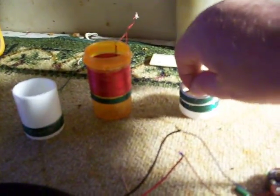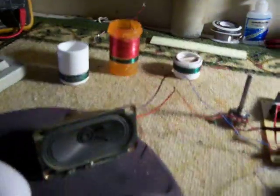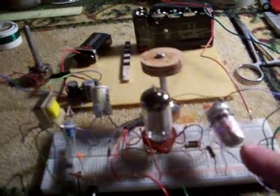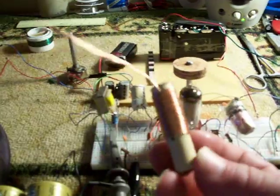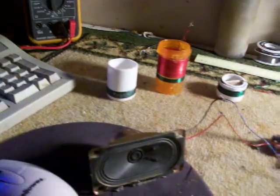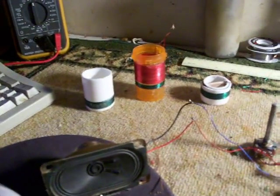And here is an interesting one for a tickler — you can make something that just plugs in. This is the coil I'm using for 40 meters, and this is the one I'm working on next — possibly for 80 meters. There is a lot of discrepancy with the windings; you have to experiment to get that band.